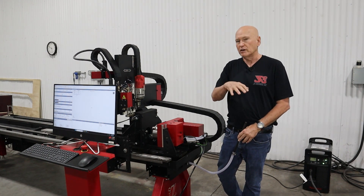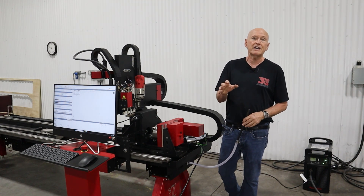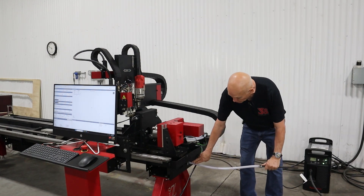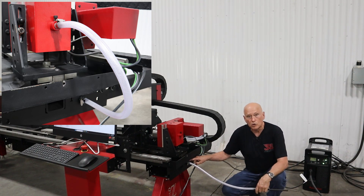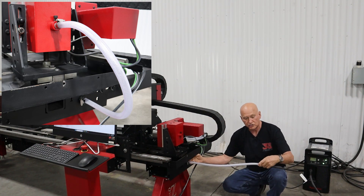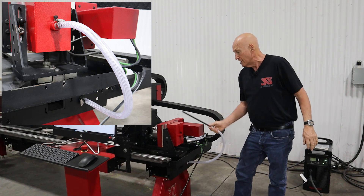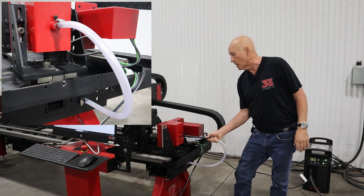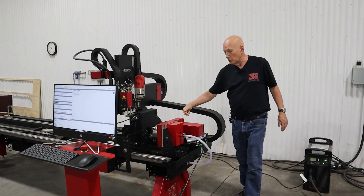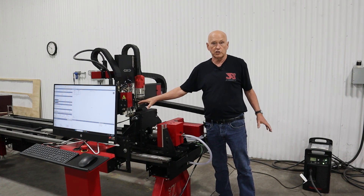We supply all of our stuff with that tubing, but if you're ever going to replace it, use braided tubing because it doesn't tend to kink as easily as the non-braided tubing. When you install it, you're going to want the tube to hang out of the machine. There are holes in the frame that you're going to run this hose all the way down through to the other end of the machine. You want it sticking out about 27 inches. The coolant will flow from the tank, run down the hose, come up through here, go through the tubing, and inject into the metal tubing on the other end of the chuck.